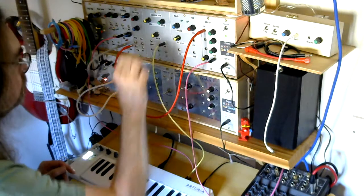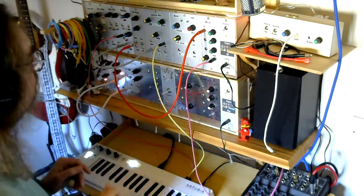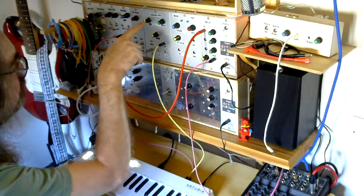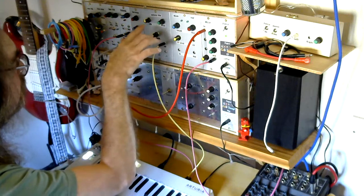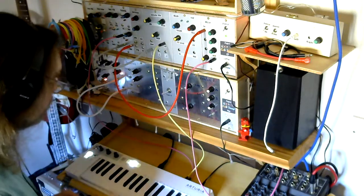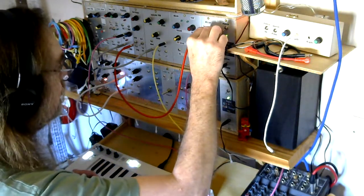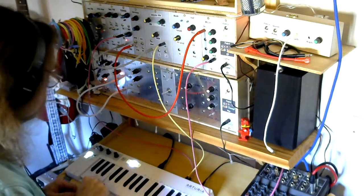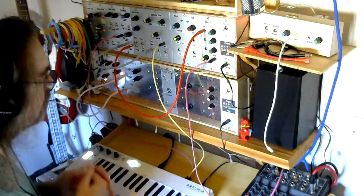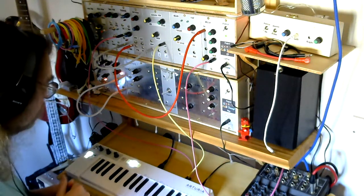If we go into the pulse waveform output, and I've got a control on the top. When we looked at the panel, we saw the control for pulse width there. I've got it set around about the centre. I better turn this back down again, because what you're going to hear is a much stronger output from the pulse width. So it's mostly the triangle wave that has the biggest drop that you're going to have to compensate for.